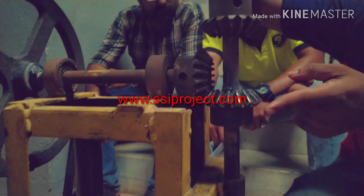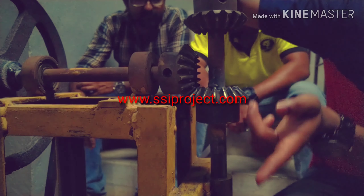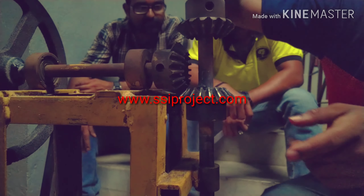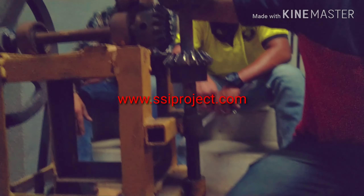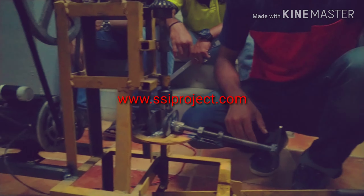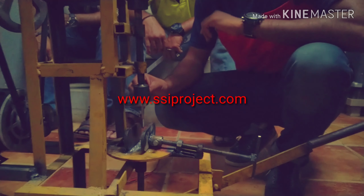The bottom gear is engaged with this bevel gear, then the tap reverses its direction, and in that way rotation can be obtained in both ways. While the tap is engaging with this gear we get the rotation and it goes in the direction to tap or drill the hole. Then if we disengage the load — that is, applying like this and disengaging like this — this bevel gear engages with this other bevel gear and the tap is rotated in the opposite direction, and thus the tapping operation is completed.